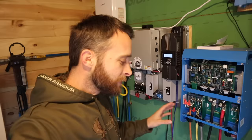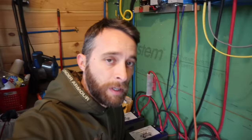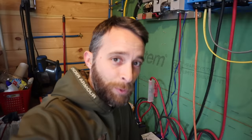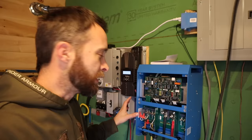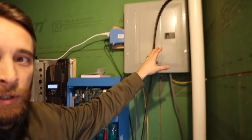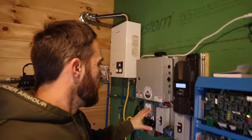I'm going to take you into my storage room, which is where my battery bank is. The room is not super huge — about 8x8 — and there's only one light bulb in here. What I have is five 24-volt lithium batteries from BattleBorn. Being an RVer, I heard about BattleBorn about two years ago; a lot of RVers have been switching to lithium and BattleBorn is very reputable in the RV industry. What I love about lithium is that you can drain them down to zero and recharge them really quickly, and they last a lot longer. This is a Victron 24-volt 5000-watt inverter — I have everything running on 24-volt — and here's your main breaker, so it goes from 24-volt to normal 110.